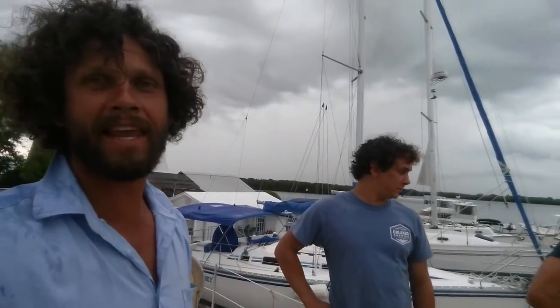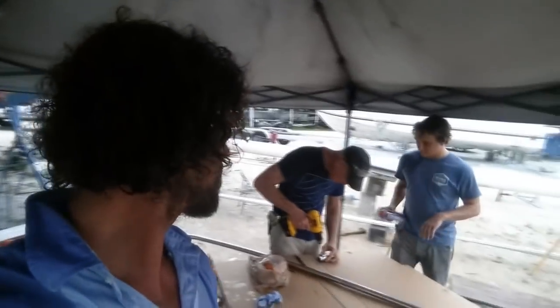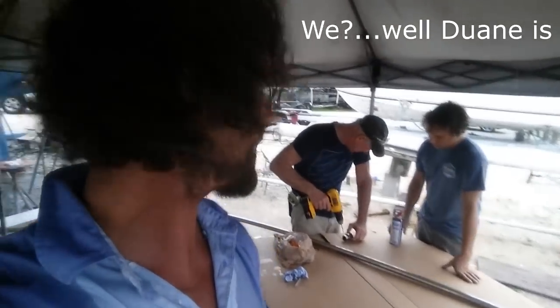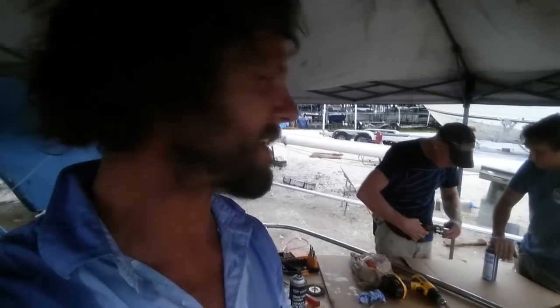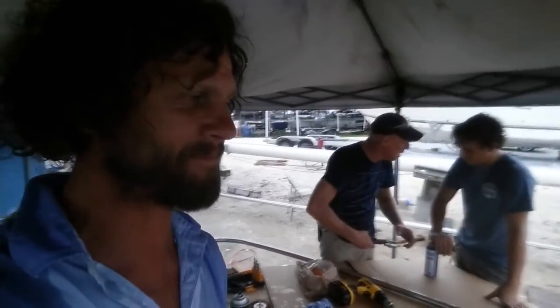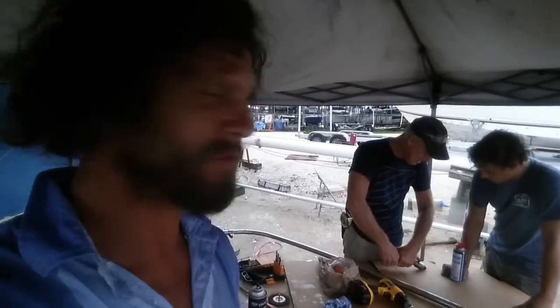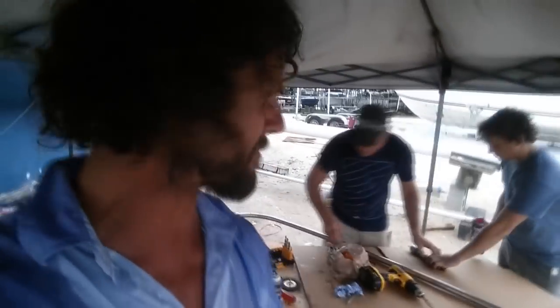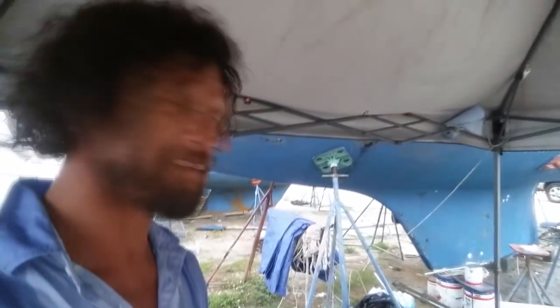And to top it off, we're working in the rain. And lightning. Thanks to Dwayne for the Taj Mahal. Well, Taj Mahal number 2. Mine was Taj Mahal number 1. We're just trying to unbodgy all of the sleeves that go up and down. All the Allen key setting screws are frozen. So we're just re-drilling them and re-tapping them and putting in 1/4-inch locking screws. I want to work on the rudder, but I really want to do it when it's not so wet.